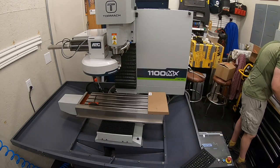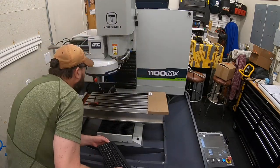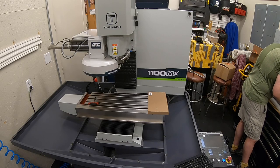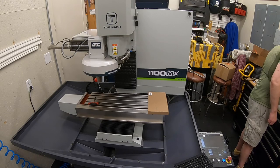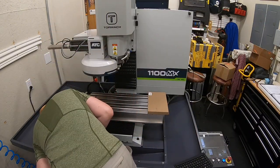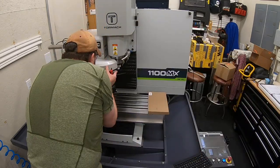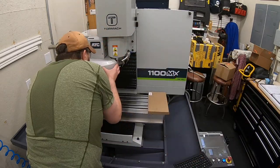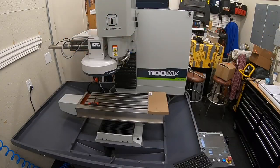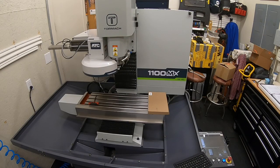I finally started looking at where it was lining up, where the tool holder was lining up on the center of the spindle, and I realized that it needed to be over a lot more. And every time you go make an adjustment on sort of moving that tool changer around, then you have to start over again on squaring up the x-axis and the y-axis. So I went round and round a couple of times with that, would make a movement, would re-square it up again. So a little bit tedious doing it for the first time, but again, it really followed what the instructions explained and how they laid it out.